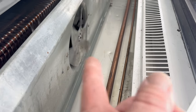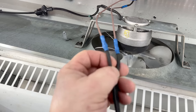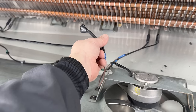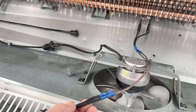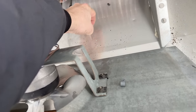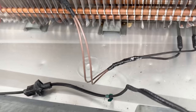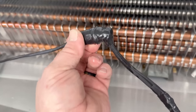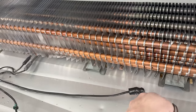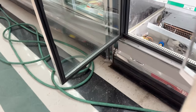See how that one does a lot better. And of course the blade's all lapped out too — good figure. So what we ended up doing was just crimping a short piece onto there — that way it's not live. Got it on there. My heat shrink doesn't go that small, so in theory it's not going to matter much because half of this wire is in the water anyway. So we got it all taped up and went ahead and put a couple of loops around the plug too so it doesn't come undone. If any water gets in there, it can pull it apart. Came out of defrost, went ahead and closed my hand valve there.